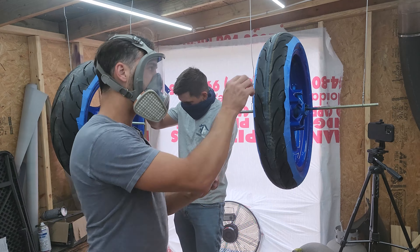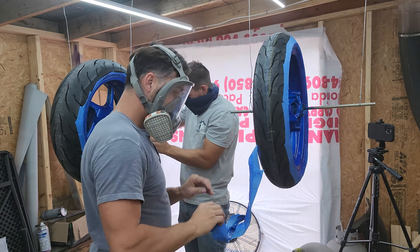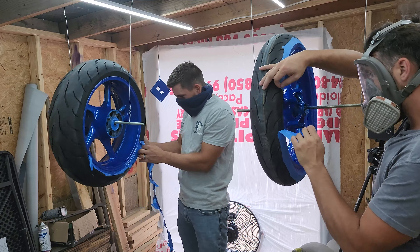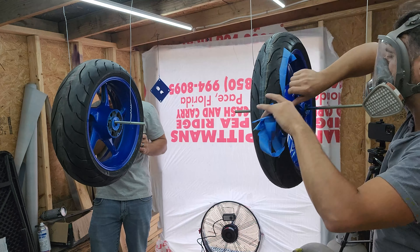While the final coat was still wet, we removed the tape and waited for it to dry. If you do it after the clear coat dries, sometimes it can lift the edges, and that's never a good thing. The finish came out fairly well — not perfect, as the prep work sadly wasn't a perfect finish, but he was happy with it and ultimately that's what matters.